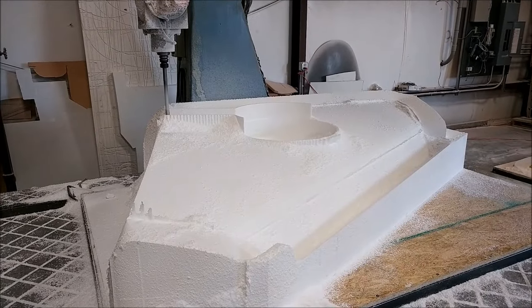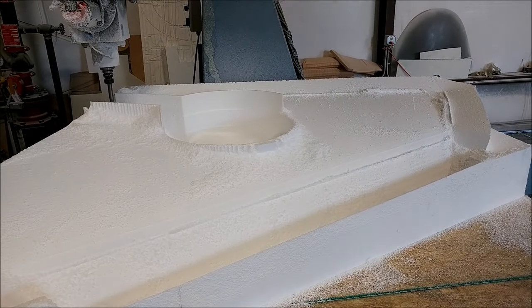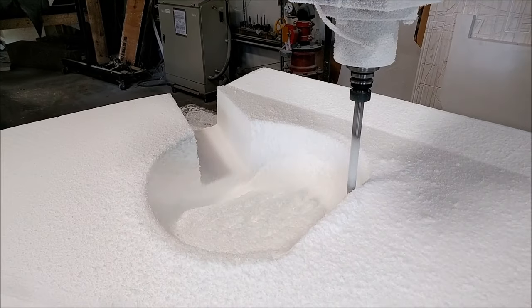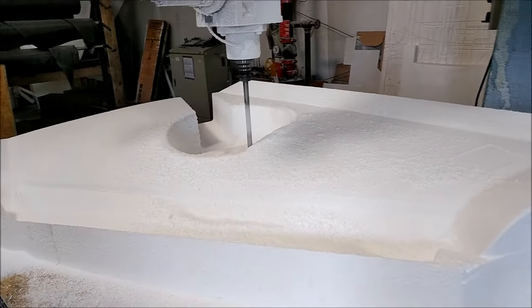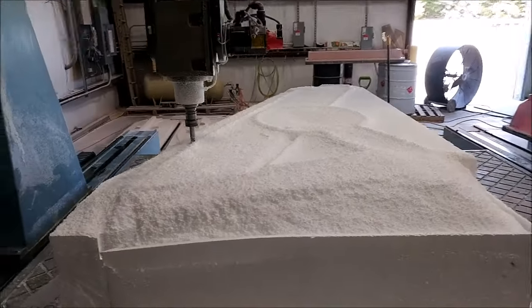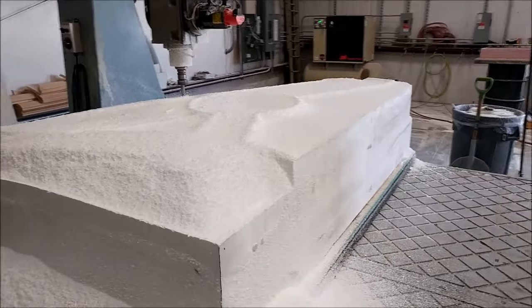Last time I was showing you in the CAD the lower side of the strake with the wheel well, and here it is up on the mill. A ball mill is running there right now, just cutting down into the wheel well — it's quite deep in there so I have to use the long ball mill to finish that off. You can see the face cut's been done. Here's the other one; we did the left and the right, and this one I believe is the left-hand side — this is just the rough cut running here.